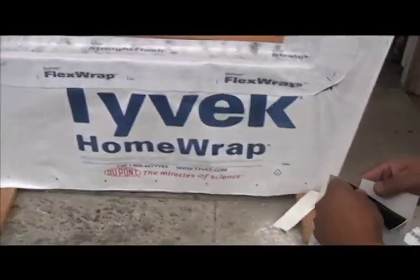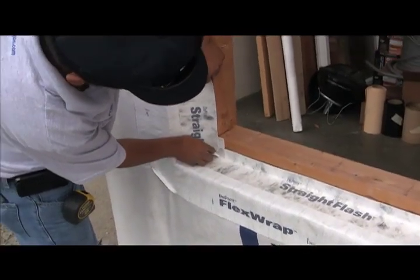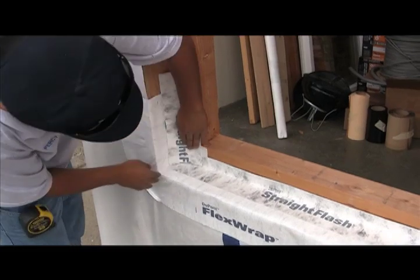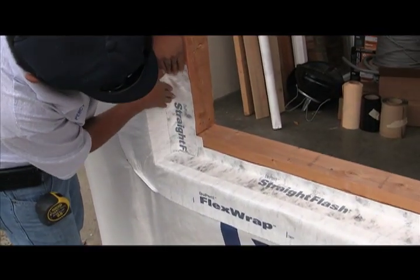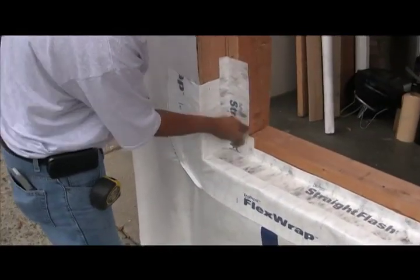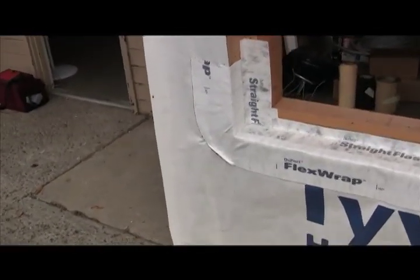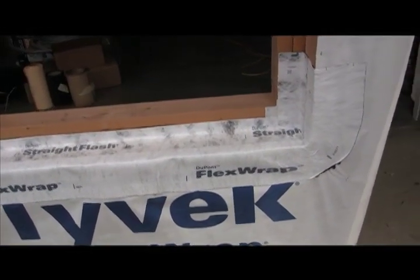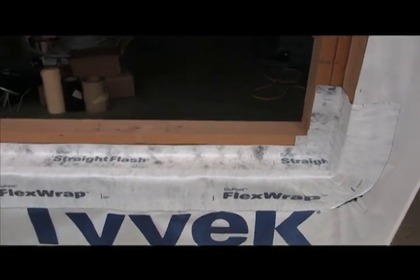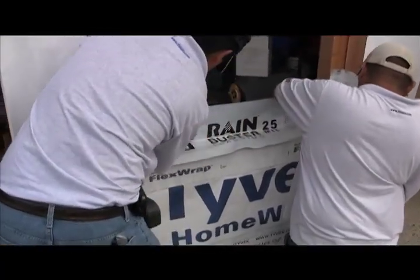So we're going to try an alternative strategy here — another piece of straight flash vertically. Unfortunately all we have here is 4-inch straight flash; we used up all of our 9-inch on a big job recently. So the next piece of membrane we use is going to be a 9-inch product by somebody else — you need to use your imagination and imagine it's straight flash. What we've done is we've got FlexWrap, straight flash, and GS FlexB corners in place so far. Because I don't have any 9-inch straight flash, we're using this product.